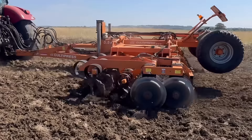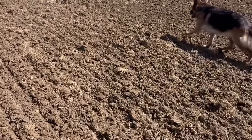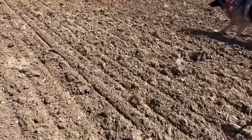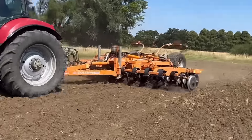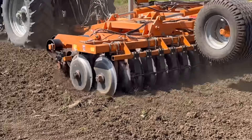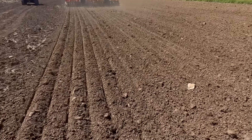So we've got the Culti-Press out and it's doing a really good job — cracking machine this, with the spring-loaded tines. We're levelling it up. It's very wet underneath still — look at that lump there. The outsides are particularly rough here. It's levelling it up well, but it has weathered awfully. This heavy soil is when it dries and bakes out solid and you get rain on it — it just crumbles. We haven't got a tine in the very outside there. It just boils lumps out sometimes, so we put it in and out depending on the conditions. Well, that's done a superb job.